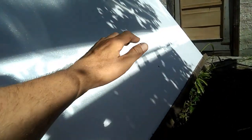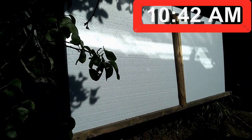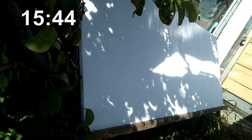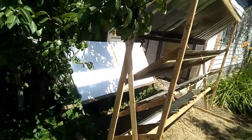Let's look at how the spot of solar radiation from immovable mirrors moves during one day, from morning to evening. It is morning, and the spot is here. These are time points during one day of the 6th of July. We see that the spot tries to heat this line all day long, and the mirrors are motionless. It is obvious that our solar heater should be positioned here.